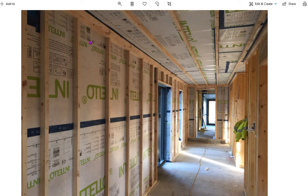So what this means is that we have our timber frame panel, we have our insulation, we have a layer of airtight membrane. So you can see the white airtight membrane all around the inside here. That has been tacked on and it's taped. That stops any air leaking out through the wall and keeps the house basically draft free. Then we put on our battens inside. So we've got these timber battens nailed on to the inside, and that gives us what's called our service cavity.